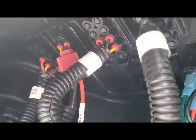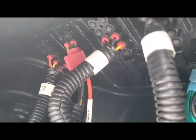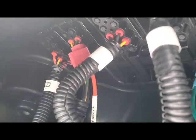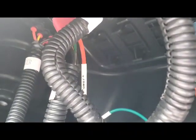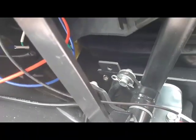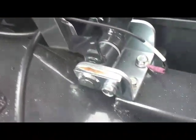I tapped into my rear wiper - there's a reason for that. It's a moment switch, so it doesn't stay on, meaning the chances of ever hitting that 10-amp rear wiper at the same time you're trying to move your chute are very unlikely. It's the green and red wire on your rear wiper. There are my connections for my switch, which are pretty obvious: power in, ground, power out, ground out to DC - everything's all connected up here pretty nice.